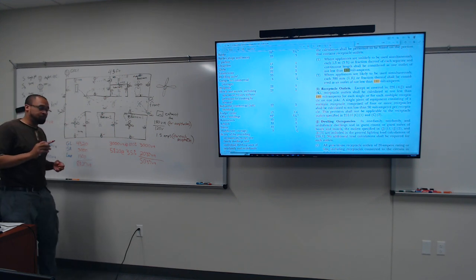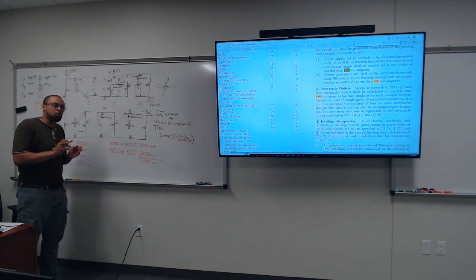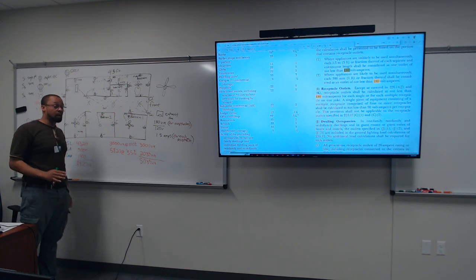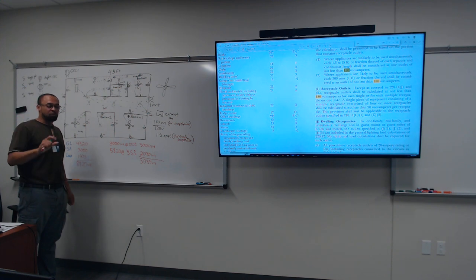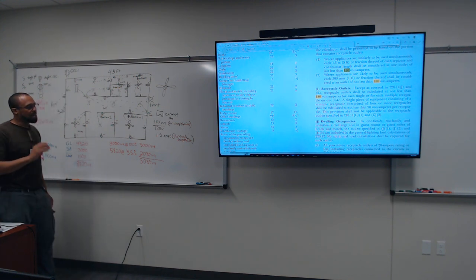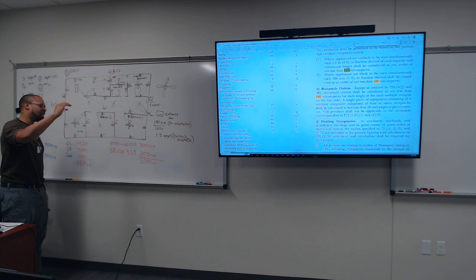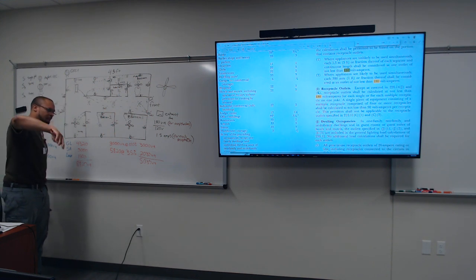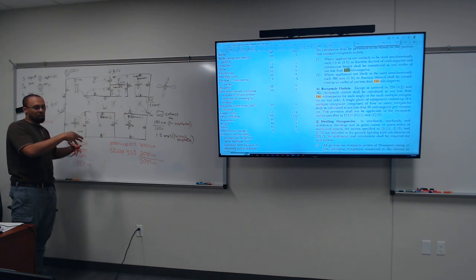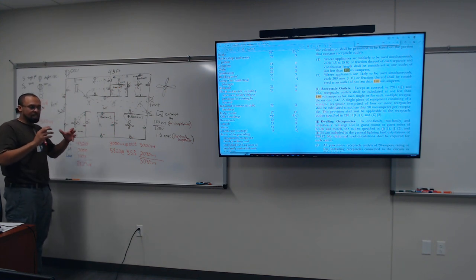So now, this is how you organize and structure your panel, so it won't be all janky and messed up. I've done a lot of electrical work, and I see where some guys have receptacles from the same room on two different circuit breakers, receptacles and lights on GFCI circuit breakers. You gotta do it the right way. But when you're building a developmental site, time is money, so they're going in and knocking that out in one day. If you do a custom home where it's just you and a crew taking your time, then you can organize it to where it's nice and neat.